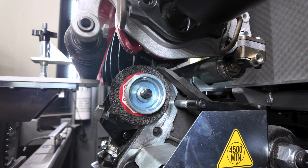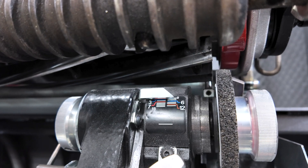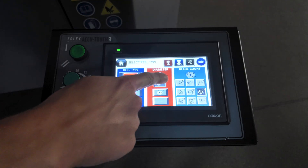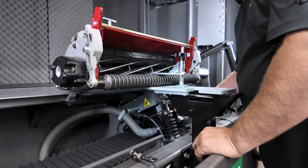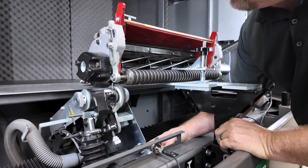Check for clearance between the grinding stone and the reel blade just above the one you're grinding, and confirm the relief angle. To decrease the relief angle, verify the diameter and the number of blades on the reel on the controller. Move the grinding head to the left until the grinding stone comes off the blade, but the blade remains on the fixed finger.